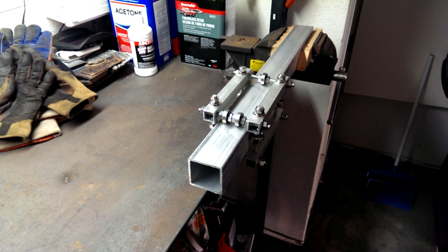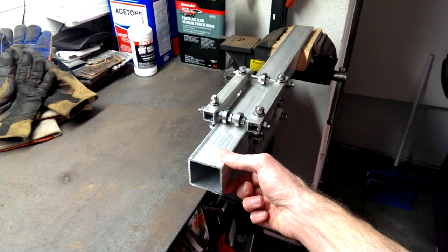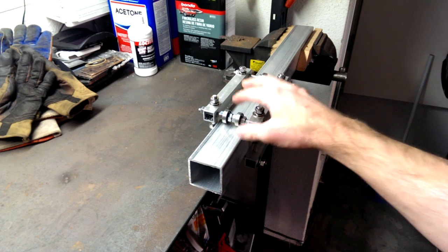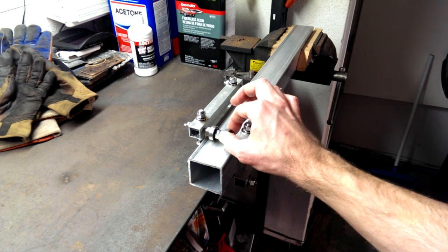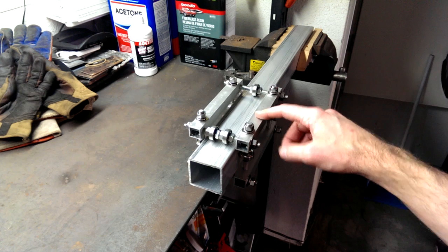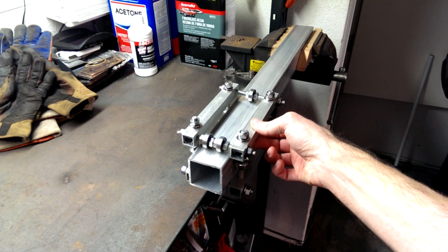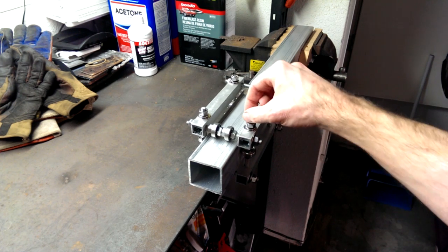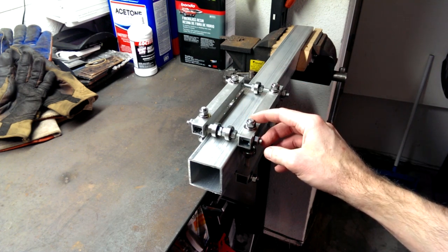I started working on the linear bearings for my carbon arc furnace, made with pretty much off-the-shelf components. This is some two-inch by two-inch, one-eighth-inch wall 6061 aluminum tube. These are skateboard or roller blade bearings — 608 from BSB, picked up a couple years ago from a sporting goods store. This is three-quarter-inch by three-quarter-inch, 1/16th-inch wall 6061 aluminum tube, and this is 5/16th threaded rod with washers, lock washers, and nuts.